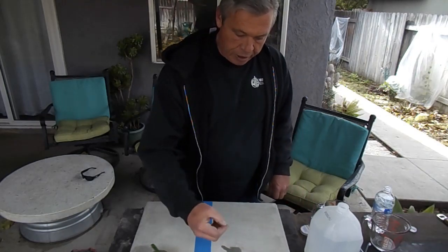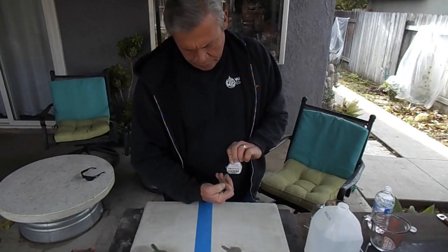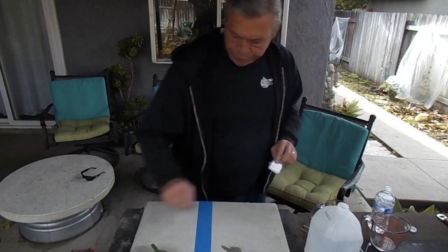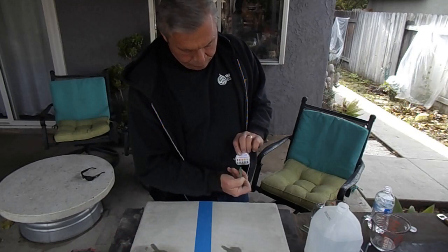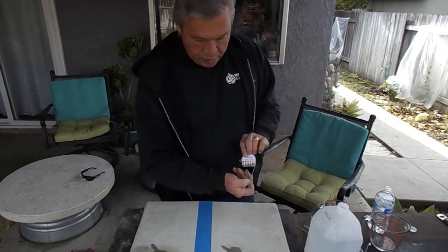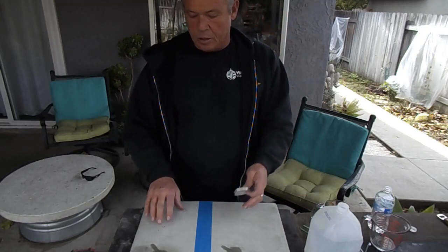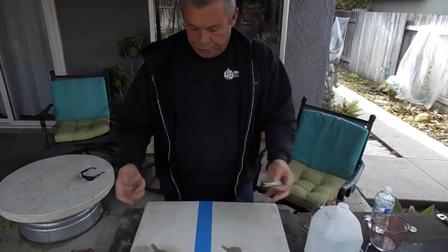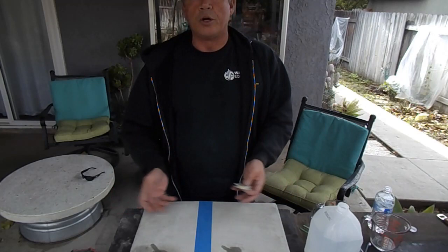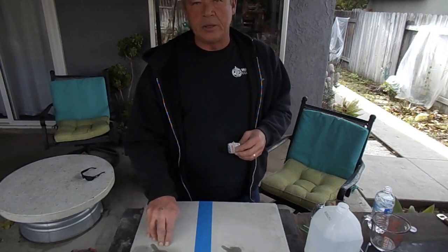Let this sit on here for about a minute. This is sitting there at a seven. Over here we're higher — just about a nine. So this is just a piece of concrete that's been sitting outside, so it's not in a position to pull in moisture from the bottom like a slab, but I still ended up higher where I ground into the interior.